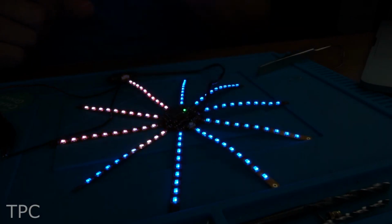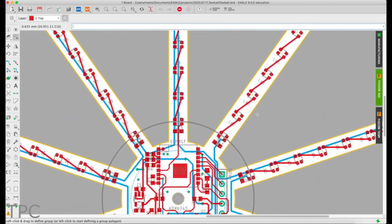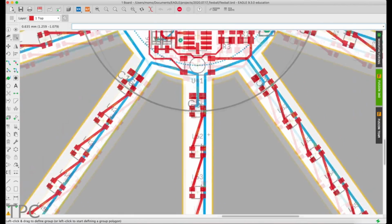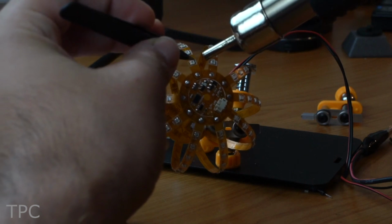While making such PCBs, there are some rules to keep in mind, like not using traces with corners or edges, as they tend to crack when bent. The same goes for ground planes, which tend to break when flexed. The trickiest part that you might face would be soldering the arms of the bottom circle to the top one.